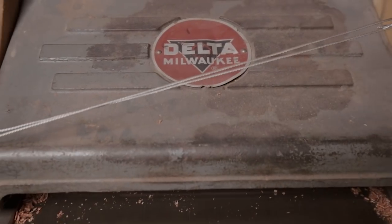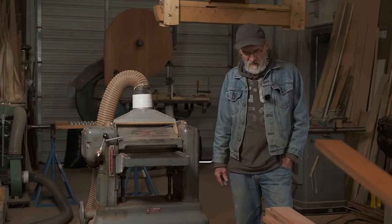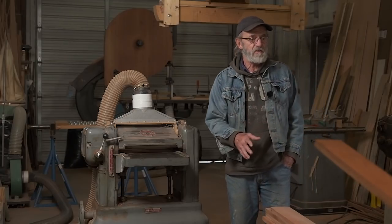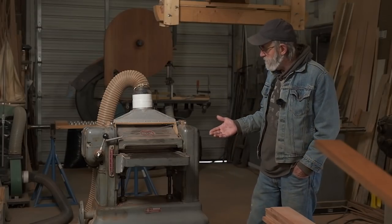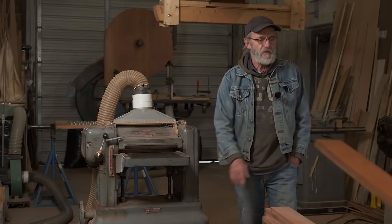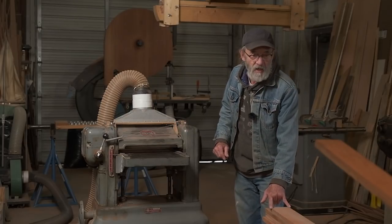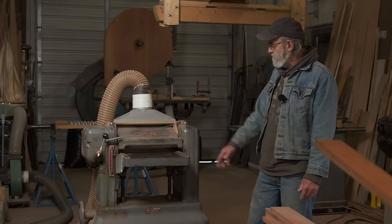We're going to be doing a little planing of our strip plank. We've processed the material in a procedure — we've got all the lumber outside, picked it all over so we have the slab-sawn stuff for the strip planking, and all the nice quarter-sawn vertical grain stuff set aside for the carvel planking. We're ripping the stuff to about four inches out in the yard and then resawing it on the bandsaw. That makes it easier rather than resawing 12 or 14 inches wide. We're cutting it down to the width we're going to use — it's double wide right now at four inches and we're only going to use two inches — which makes it very easy to resaw.